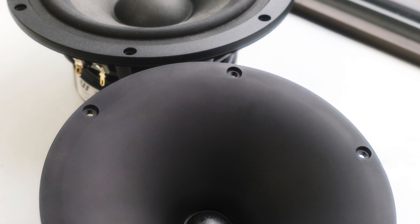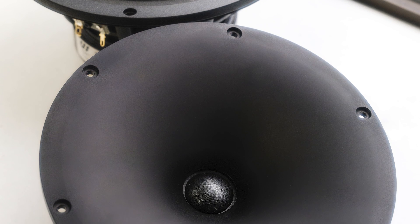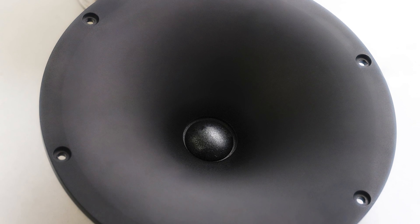That is not necessarily a bad thing, but when you're mating up to a larger driver, the larger driver is starting to beam and off axis the energy is dropping off very quickly on a larger woofer. On a seven inch woofer above two kilohertz, you're getting some pretty significant roll off in the top octave, whereas a standard tweeter is starting to get much broader down at those frequencies. Overall, a driver's off axis behavior is really dictated by the size of the diaphragm — the larger the diaphragm, the faster it's going to roll off off axis at the higher frequencies. It's going to be broad at low frequencies and then narrow at high frequencies.